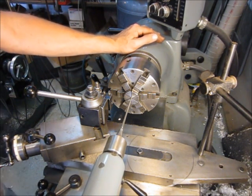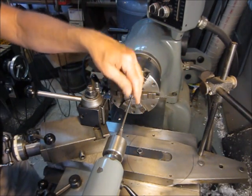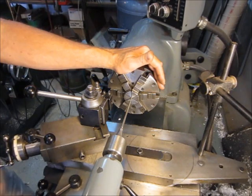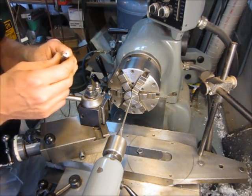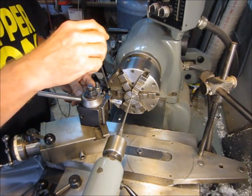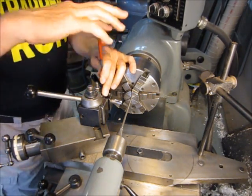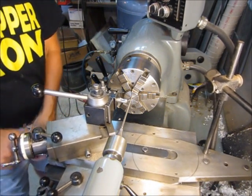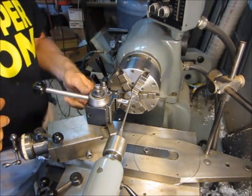Support the other end with the tailstock. Some wire — the bigger stuff — could take a lot of force to form. If you don't have the end of the mandrel supported, you'll bend it; it won't wind up, it'll bend the mandrel and break it off. Don't ask how I know that. Now let's mount the guide — just mount it in your tool post, V-side up so you can see what's going on, stick it out an inch or so, and get it good and tight. We don't want anything moving when we're in the middle of winding a spring, so tighten everything down. Center it vertically so the bottom of the V — or roughly the center of the wire — is about on the center of the mandrel. It's not critical, but get it somewhere near there.